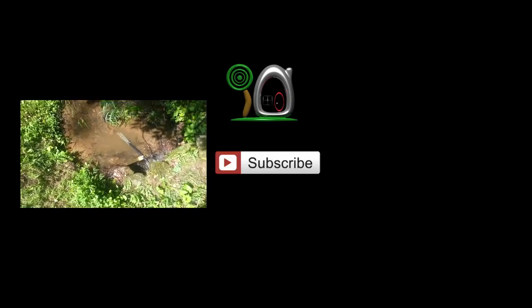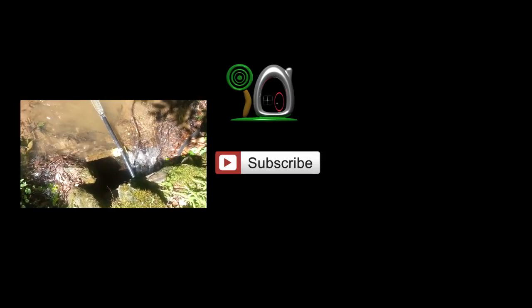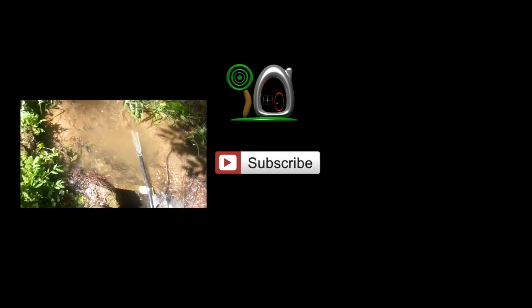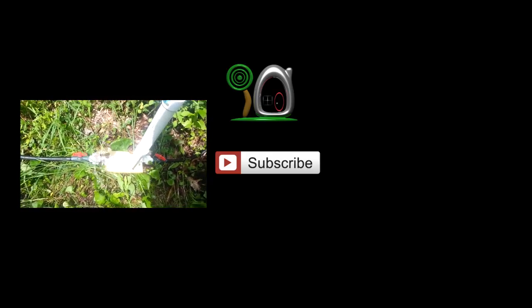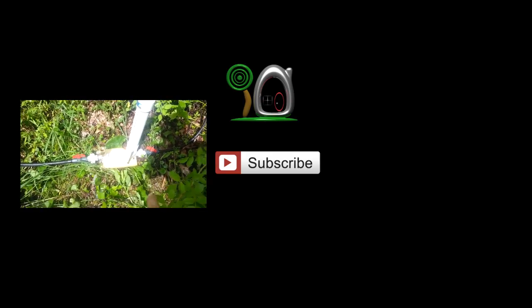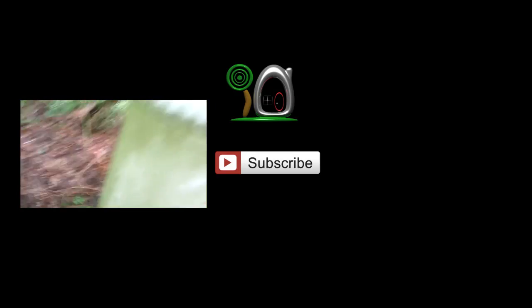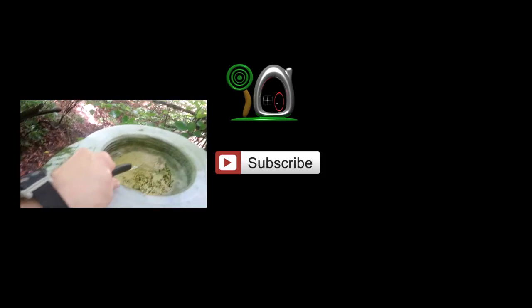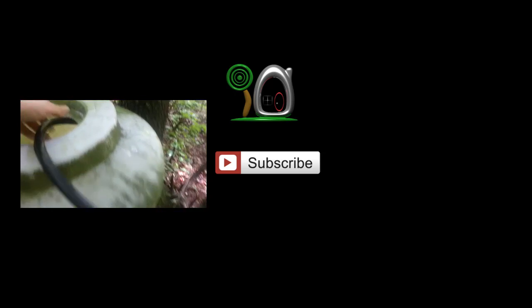Thanks for watching this installation video. The Yummy Mud Puddle has ordered two of my pumps and this is the first one. This one proved to be quite difficult because I was pulling water out of the pond and having two delivery pipes, which I've never done before. So I learned a lot, I hope you did too. Oh yeah, and using wood with rebar to support those pipes from jumping around — that was brilliant. Anyway, thanks for watching, and if you want to see the second ram pump installation click the link here to your left.